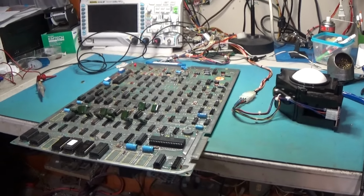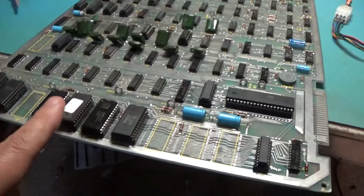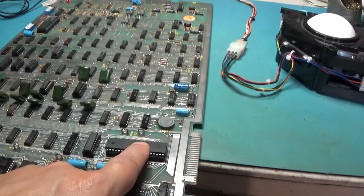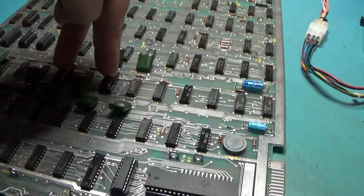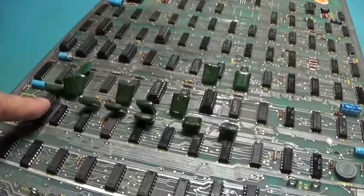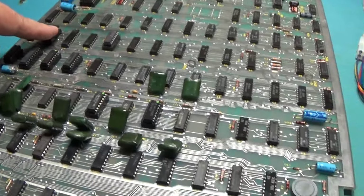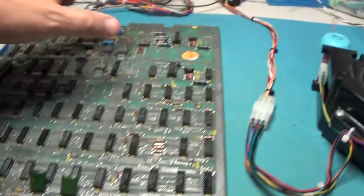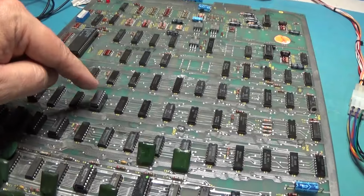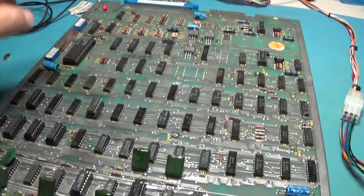All right. Thanks for watching, everybody. Well, let's go through what we replaced. The 1 ROM. CPU. 2 RAM chips. TTL 1, 2, 3, 4, 5, 6, 7, 8. 8 TTL chips, the 2 CMOS chips in the trackball circuit. Bipolar ROM for the color bits. It was missing, remember. And a Pokey.